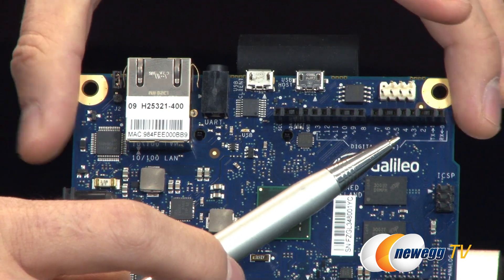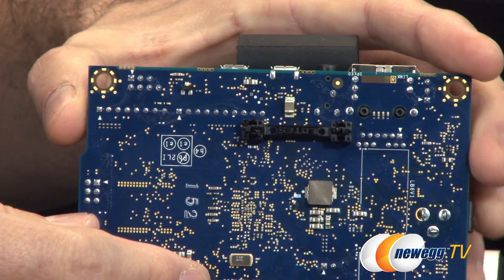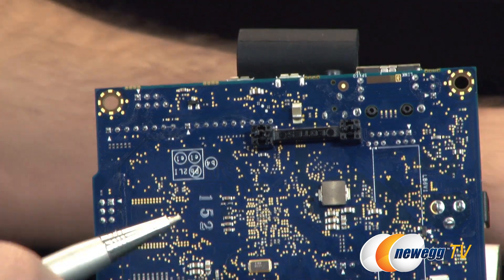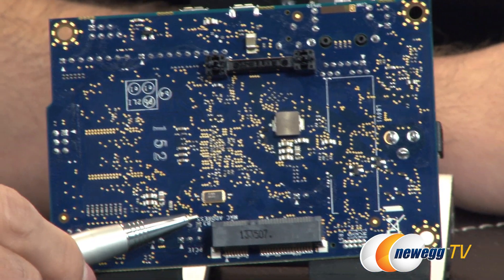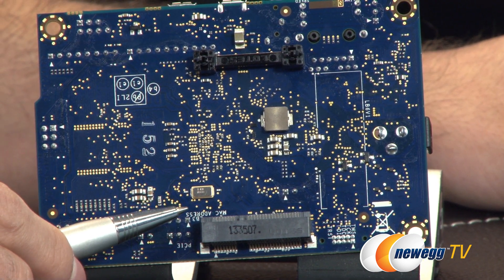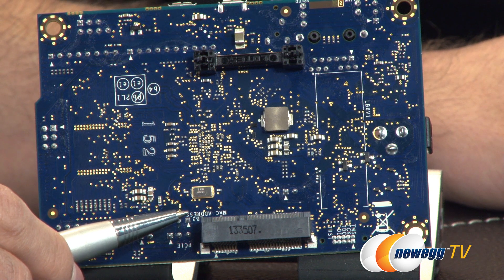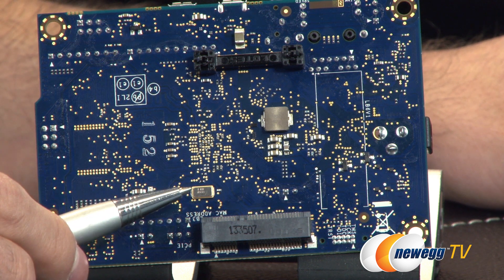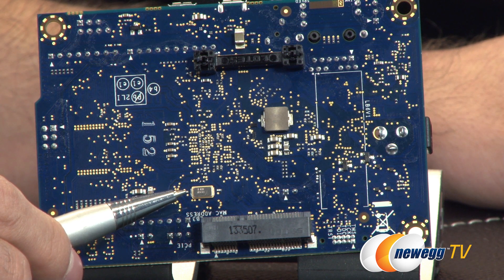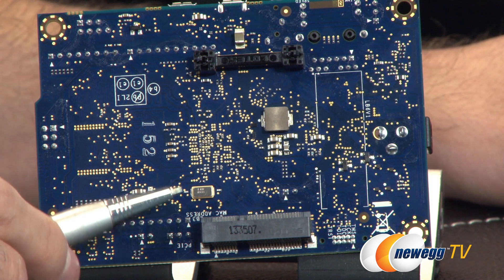On the opposite side of this board — flipping it around — there's a full PCI Express mini card slot. It is PCIe 2.0 compliant, and with an optional converter plate, you can use half mini PCIe cards as well. It also provides a USB 2.0 host port at the mini PCIe connector.